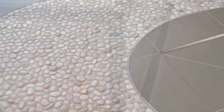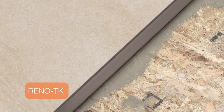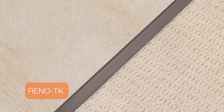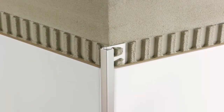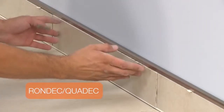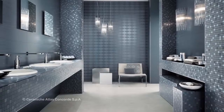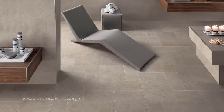Transitions between floor surfaces and at thresholds are particularly vulnerable to damage. Schluter Systems offers a variety of floor profiles to provide edge protection and transitions at thresholds and between adjacent surfaces. For example, Schluter Reno TK is designed to provide a smooth transition from tile coverings to floor coverings at lower elevations, typically carpet. Wall profiles like Schluter Rondec or Quadec make it possible to create a tile base using field tiles without ceramic trim. This simple approach increases the utility of the room and produces a clean, finished appearance. Tile surface coverings are beautiful, durable, hygienic, and easy to maintain.